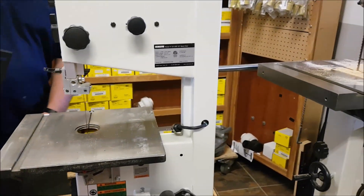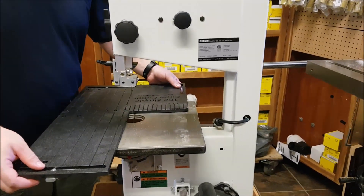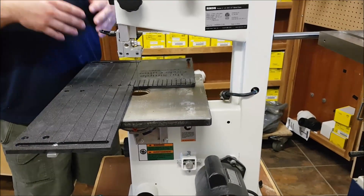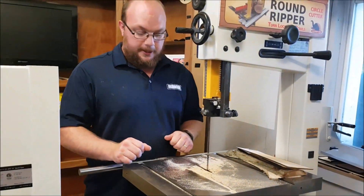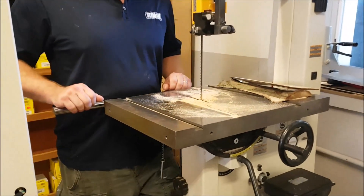If you're looking at a piece of machinery and it doesn't have one of those standard sizes, that's fairly important to note. Having a standard size miter track matters for jigs and different attachments to fit into it. The other thing to look for with miter tracks is the spacing between the track and the blade — let's go for a little walk and check out some different machines.